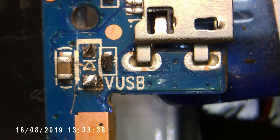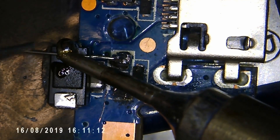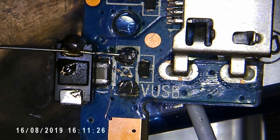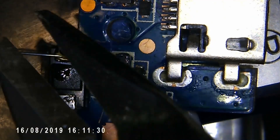First let's get the faulty component removed and clean up the pads and see where we go from there. The solution I've arrived at is to tack the diode down with some super glue and then I'm just going to put some flying leads to the pads. Don't be concerned about the closeness to the ceramic capacitor as that was across the diode anyway.